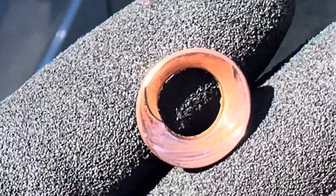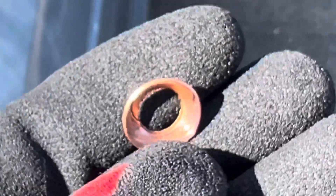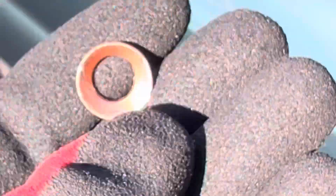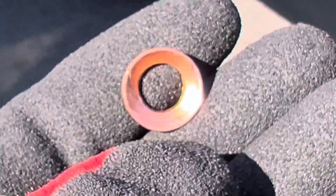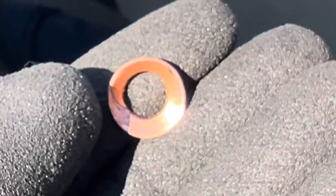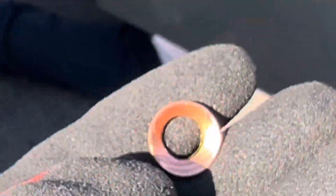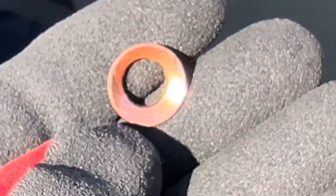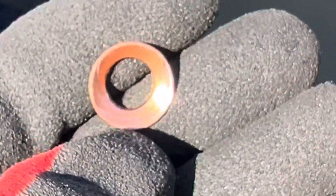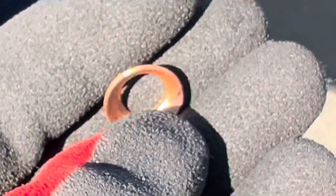You use a little dielectric grease, or you could use a little refrigerant oil or Nylog to hold it in place, and then you hand-fit it and push it with one hand. It's hard — it's in a really hard location. It's not easy to hold it in place and tighten it at the same time without this little crushed gasket kind of flopping or falling down. I've had this problem — my father taught me about it — and that's where that leak was from.